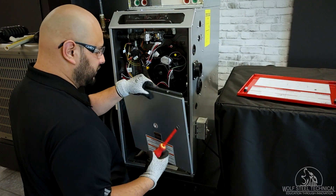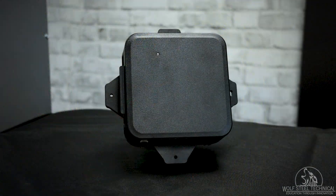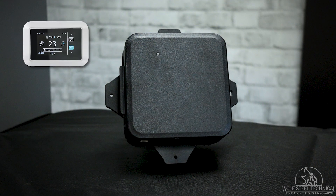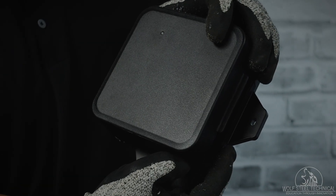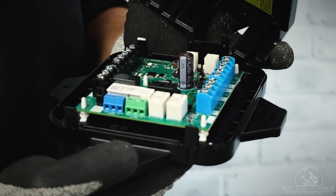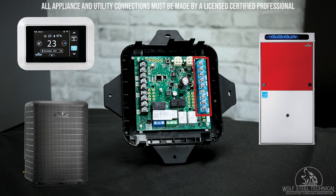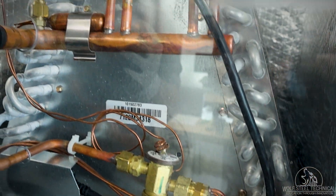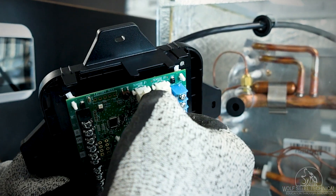It's suggested to wire the mitigation board prior to mounting it in its final location to prevent wire strain. To make this system operate as intended, the thermostat, furnace, and outdoor unit will need to be wired to the mitigation board. To access the wiring, remove the front cover by releasing the four locking tabs in each of the corners. The thermostat and condenser for the AC or heat pump will need to be directly connected to the left-hand side of the control board on the black terminals, with the connections to the furnace or air handler on the right-hand side on the blue terminals. Locate the sensor wire and connect it to the sensor one location on the control board, ensuring the latch is locked and the connection is secure.